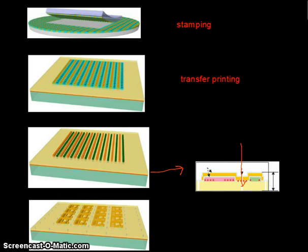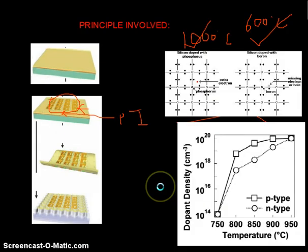Once this is etched away, it creates contact windows which essentially establish the various electrical contacts. In this way we actually create the holes which establish the electrical contacts. This whole substrate is then dipped in acetone so that all the sacrificial layers are removed, and what we essentially get are these free-moving wavy forms. For the formation of stretchable and wavy layouts, the circuit is then transferred to an elastomeric substrate of PDMS.